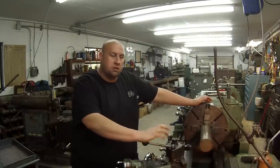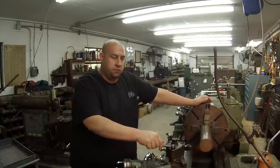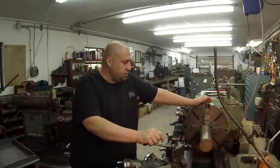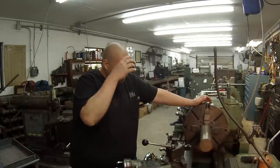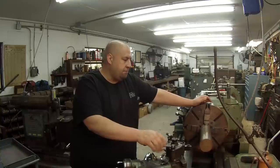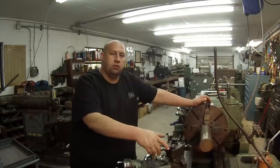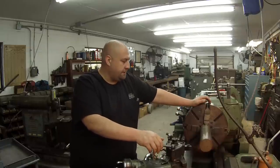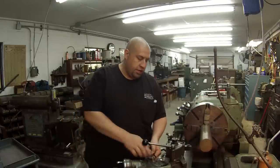This is kind of a response to some of the guys that asked me if I was going to do this — I told you I will, and I'm curious to see how it does also. If we get some differences, depending on how bad it is, we may try to tweak the lathe a little bit. I've got to admit I've never done that before, so when I watched Tom Lipton do it, it was a learning experience — I had never actually moved the ways a little bit to get some twist out.